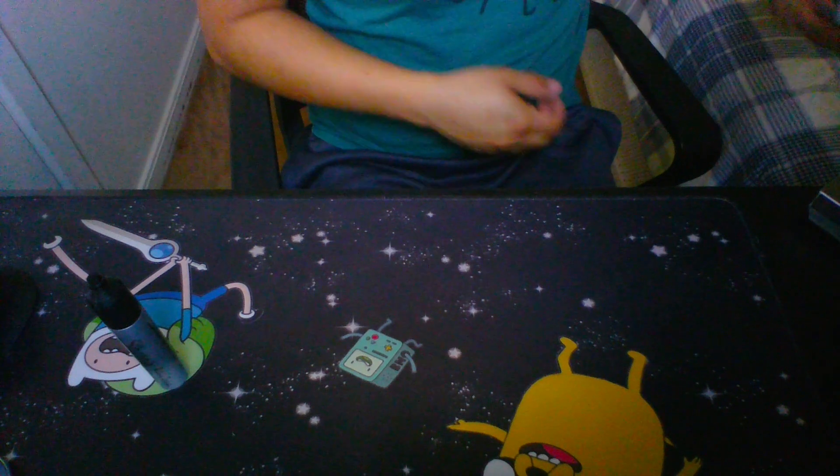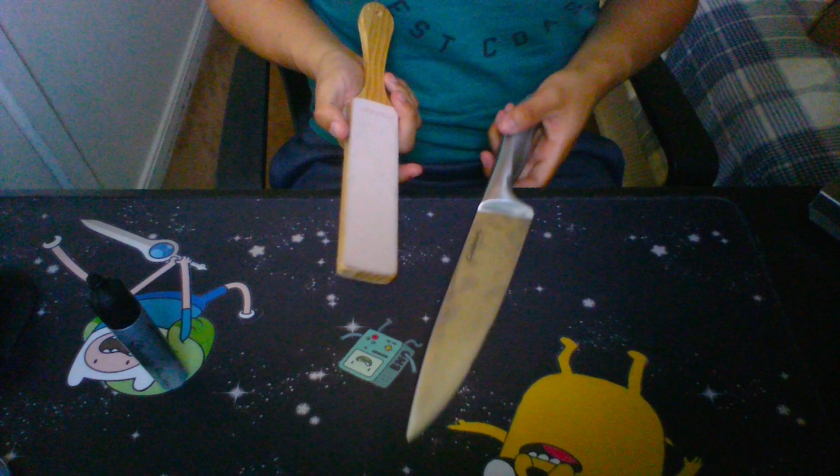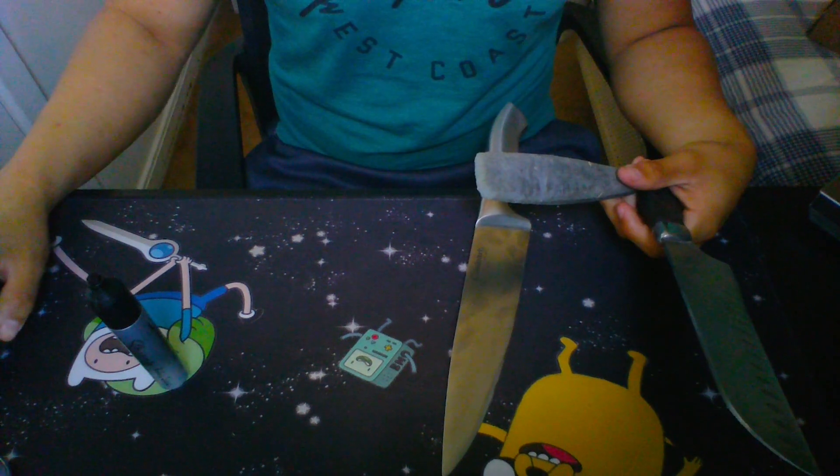Another thing: if it's an older knife — like a kitchen knife my mom was using — she would rub on it with a big old stone, trying to sharpen both sides. That gives it an inconsistent angle, so you're not gonna have an angle at all or even an edge. That knife looked really wonky. This is like some volcanic rock she was rubbing it with. It starts off here and then it divots down, because she was just going like this to it and it didn't have a consistent angle. Now it does because I took a long time on it, and it's kind of mirror polished.